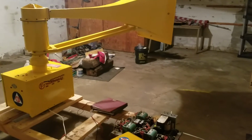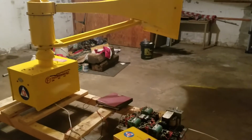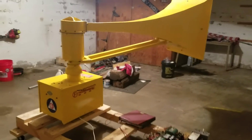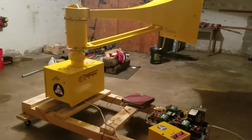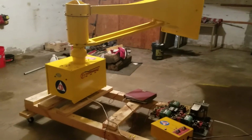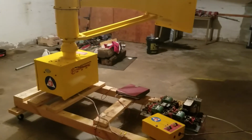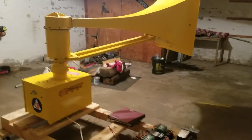So in the event they were testing them like that, they could send the alert tone, wait like 30 seconds, send the attack tone, and attack would take over. Let it run for maybe a minute. They could send a cancel tone and immediately send an alert tone, and it would switch back to alert and finish the rest of the cycle, which would be very long. But that's how you go back and forth.